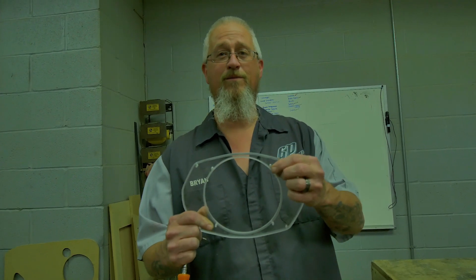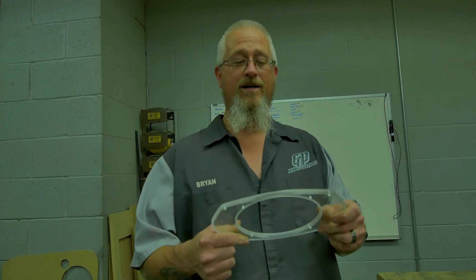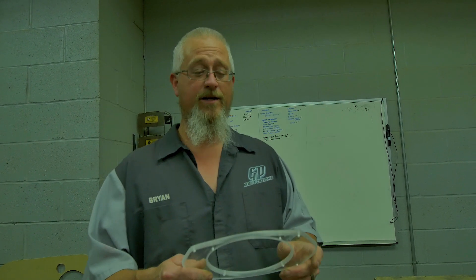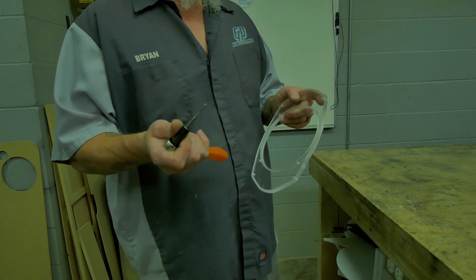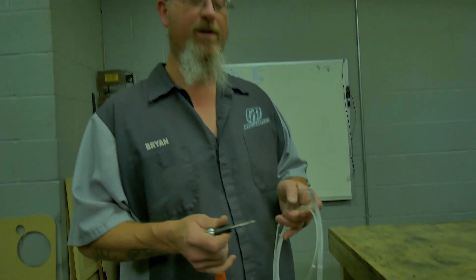The next question you might ask is: what kind of screw am I supposed to use through plexiglass? Everybody knows if you try to drive a screw straight through plexiglass, you're going to crack it. Another reason I like plexiglass is that I can tap the speaker mount holes. I normally tap them at 8-32, so I'm going to tap these real quick and then show you how easy it is to put a screw in afterwards.